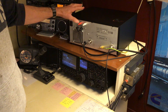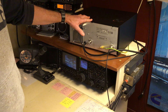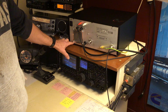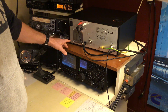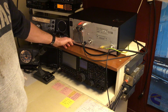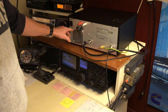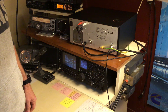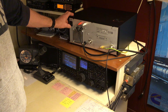I don't really use mine on digital modes — they can get quite hot on digital modes. I think I've used it a handful of times on PSK and RTTY when that used to be a thing, not so much nowadays. You do see some people put external fans on them, so that could be a thought if you use it heavily for digital modes. But on SSB I see no need for that at all. I've used this in pileups for 3 or 4 hours here in the early hours of the morning in Australia and it's never missed a beat. On sideband there'd be no need for that.